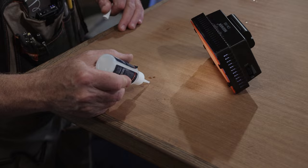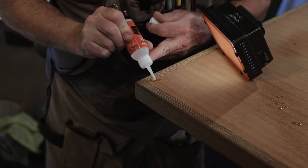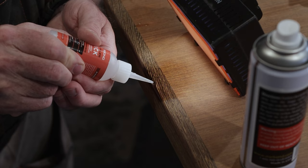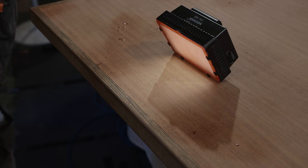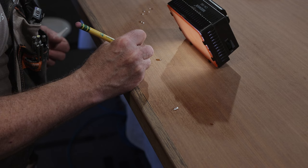We're going to use medium for these guys. We got this one right here — we'll use the thick. There's a dinger right here, and a gasher over there. Let's spread it out a little bit too. I mean, you can't really ruin these tables, they're already ruined. And usually I fill these with epoxy. So we're going to use the thick gap filler. The first thing I'm going to do is spray it with activator, and then try to squirt some of this in there and see what happens, then spray over the top of that. We're also going to try just putting some thick in one of these holes and not activating it — I wonder how long it would take to dry. I've got to go to lunch here pretty soon, so we'll just let it sit. Try not to touch the tips, otherwise you glue your fingers together and that ain't no good.